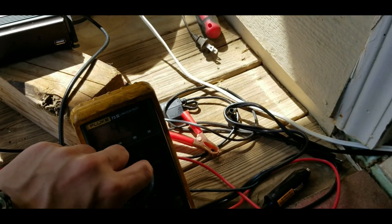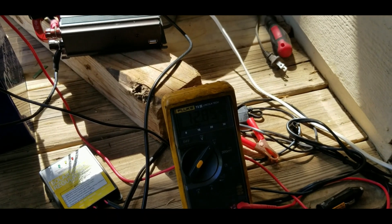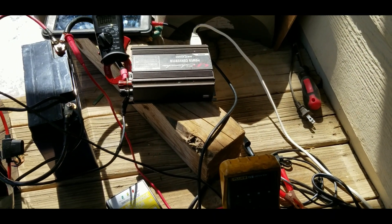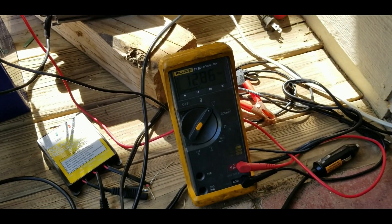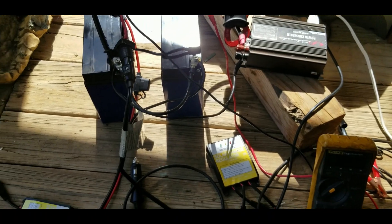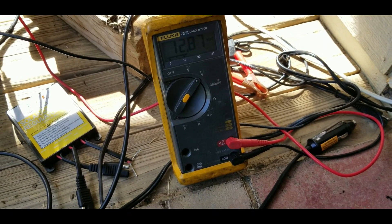So that's what the panel will run. I'm getting almost 100 watts out of a 100-watt panel — pretty good. When the sun isn't blocked it definitely charges the batteries and puts out 90 to 100 watts, and this is all on a modified sine wave. I'll do a Part 3 update with the pure sine wave inverter. Right now this is running about 65 to 70% efficient — everything's kind of just slapped together, but it does work and will work in a quick situation. Thanks for watching, please subscribe.